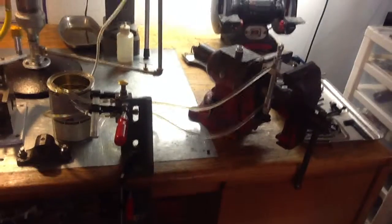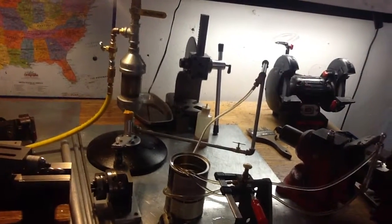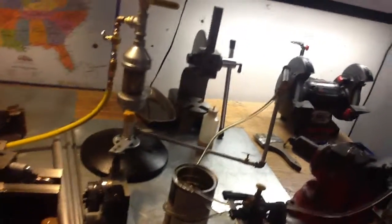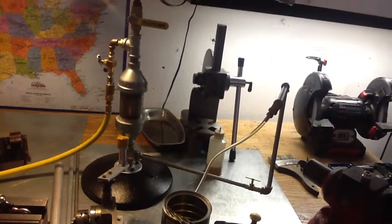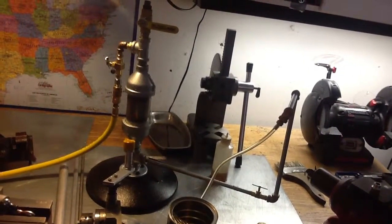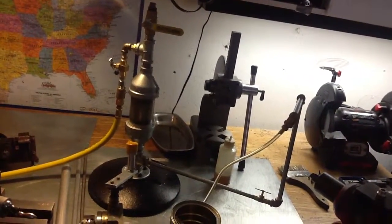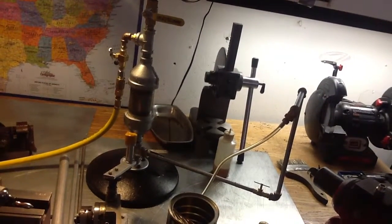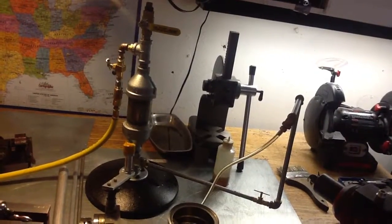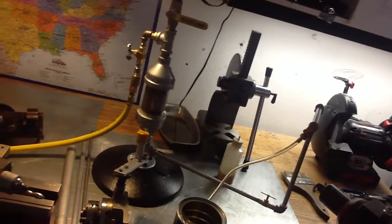Let me talk about how we're going to power this up. I don't have a pump yet — eventually I'm going to try to get maybe an old oil pump from a car or maybe just an old hydraulic motor from a junkyard and try to connect it up. But for now what I've done is I'm just using this oil pressurizing system that I built for the lathe, to use as kind of a ghetto coolant system for cutting, especially doing parting. It really helps for doing parting on the lathe. I know I should be using real coolant, but I don't know where to buy it, so I'm just using common motor oil as a coolant for my lathe. And that's originally what this gizmo was built for.